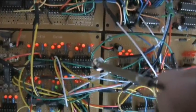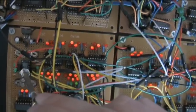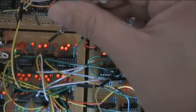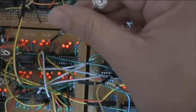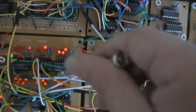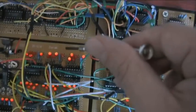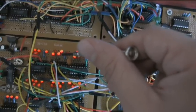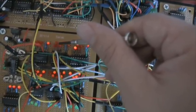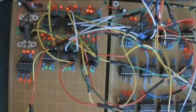You'll be able to see what they do. Basically the signal comes out from an oscillator at a high rate, and then you get divisions of it. The blinky lights tell you what the divisions are. You'll get really super fast audio rate clocks here — they're going so fast it looks like it's just permanently on, but it's actually blinking on and off very quickly. And then here the signal is divided so much that you see the actual divisions.